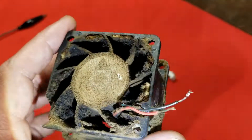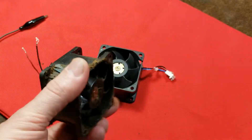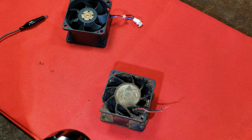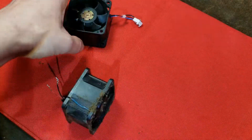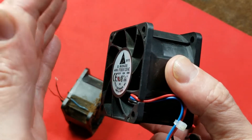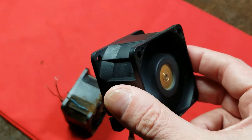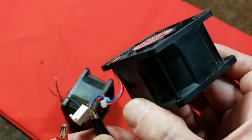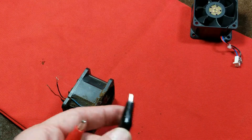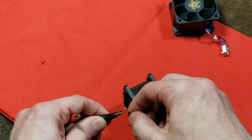I thought that was a good testament, and one of these nice Delta high-performance fans will really keep running under literally the harshest conditions. Let me see if I can pop the rotor out so we can see how bunged up this fan is — and I believe we can still get it to turn. Let me show you what a normal one sounds and runs like. You can see it's not too bad — they're rated at 55 dB at one meter. Be super careful with these fans since they spin fast with a lot of mass; I recommend using the guards.